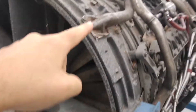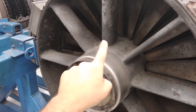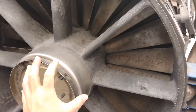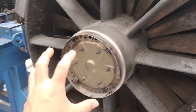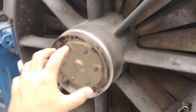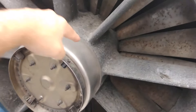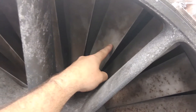Right here, where it goes through the struts, you have the air coming through the struts. These struts are hollow, so now you have hot air being pumped through the struts, heating these up, preventing the buildup of ice on these struts. From there, it continues into the center section and it flows out through that port right here into the nose dome. There's a dome that is missing right now, but there's supposed to be one here — that also gets heated by that anti-ice air. But this is a closed cavity. From here, the air gets fed back to the IGVs, the inlet guide vanes. These are also hollow, also heated.